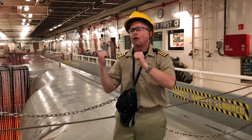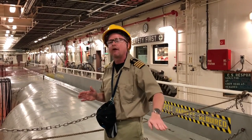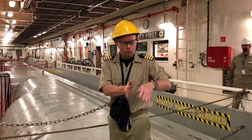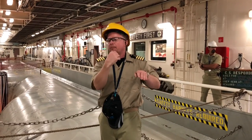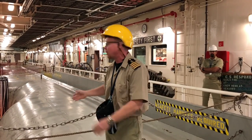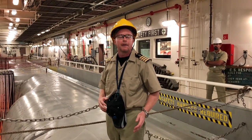And then we travel along forward, pulling this plow, never more than a knot, depending on what kind of burial we're getting. So we're going quite slow, but we're burying the cable. Then, when we're finished at that burial point, we'll stop, go back to recover the plow, and loosen it. They grade up and out. We pick up the plow, bring the plow back up on deck, stop her off the cable, same thing, grab it, take it out of the plow, put it back into this troughing, and then continue laying away just like I went over right here. That's the whole cable installation and cable vessel process right from here, okay?